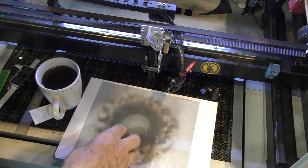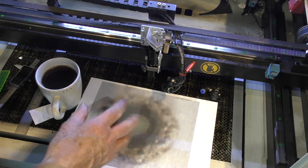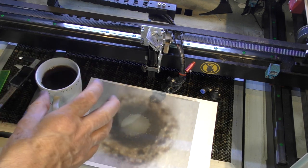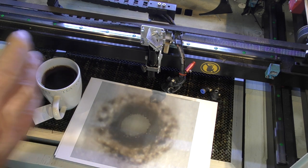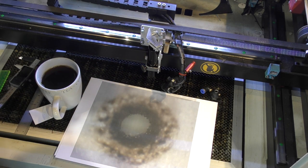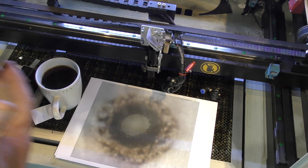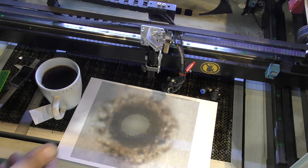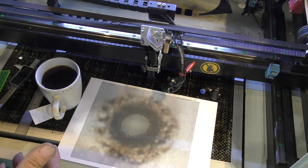Now there's also something else called a theoretical spot size, and the theoretical spot size changes for the focal length of the lens. If the focal length changes and physics doesn't change, if we can work with 10 microns as our smallest hole, why can we not get 10 micron smallest spot size for every lens type? It's just because in the practical world, they've found that it isn't possible. So there is a theoretical lens formula which puts in some sort of fiddle factor, which gets us from 10 microns up to some other dimension, which is theoretically achievable by calculation.